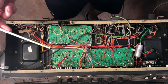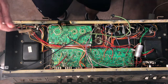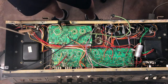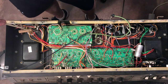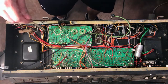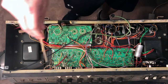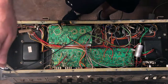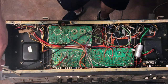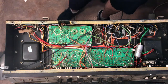One other confusing thing about this, and where I was not sure: the other amp that I'm working on, the other VT-22, same vintage, it was recapped. And they didn't replace it with a cap can, they did it with discrete components, and they really did a number on where it was grounded. I could not figure out, knowing that these amps are generally a bus structure through the amp to one single point tied to the chassis, to the ground. I knew that something was up because that was not how they were structured. That is the reason why I actually bought this amp.